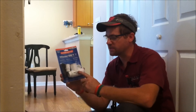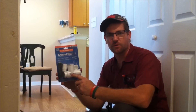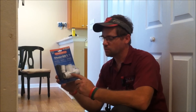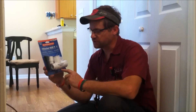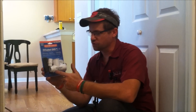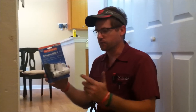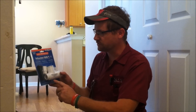My name is Les Broadbent and I'm here to talk about the safety drain switches that we put in our air handlers. Most air conditioners will have these in them nowadays per code. This is a low voltage switch which goes into the low voltage side of your air handler. It's very safe — there's no worry about high voltage problems. It just ties right into the low voltage.